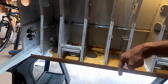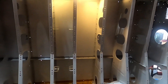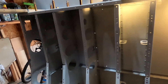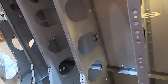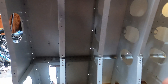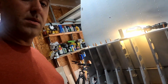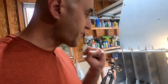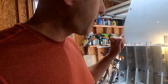This is up, that's forward, that's to the back. I got finished riveting these seat ribs — thank you to my wife for helping me do that. Well, most of them. We didn't do all of them because I stopped when I saw cracks starting to appear along these rivet lines, just on the edge of each rivet. Then I went back and looked more closely, and there were cracks everywhere. Almost every piece of metal I already assembled has cracks along the dimples.